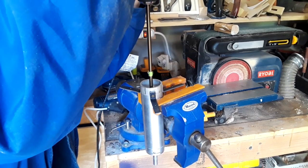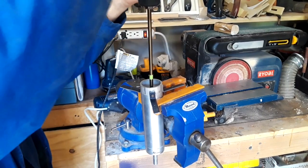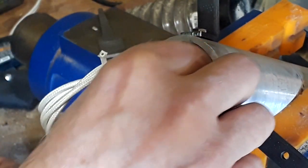The hole was 5 inches deep and it was kind of hard to drill, even with a new drill. What's more, I had to auger the hole out to make it slightly bigger — I wanted the cartridge heater to slip in and out easier.